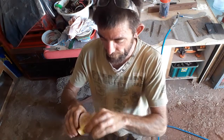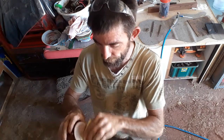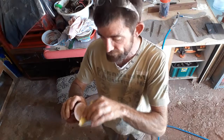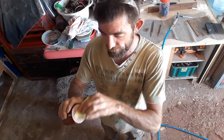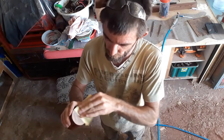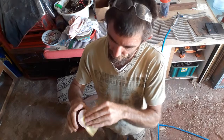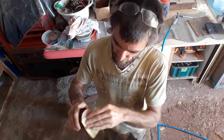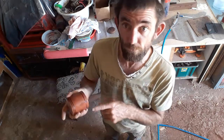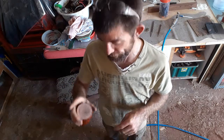Just keep changing the bit of paper that you're using so you're not wearing away on the same spot, not wearing away the wood. It's going to go a little bit white and fuzzy again because you're doing it by hand. That's alright, it'll come off. As you keep sanding down, it all comes back smooth. And then once that resin hits it, it'll all change back into the normal colour. You can get really pedantic and make this dead smooth, like we did on the outside and all that sort of stuff. But yet again, it's going to be written over and it's the base of the cup.